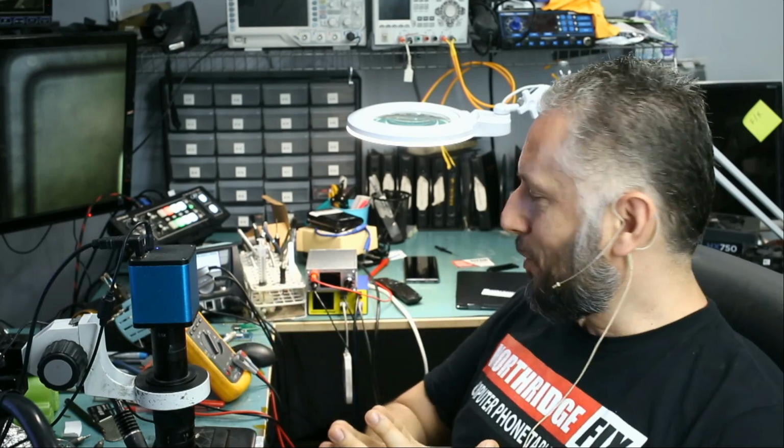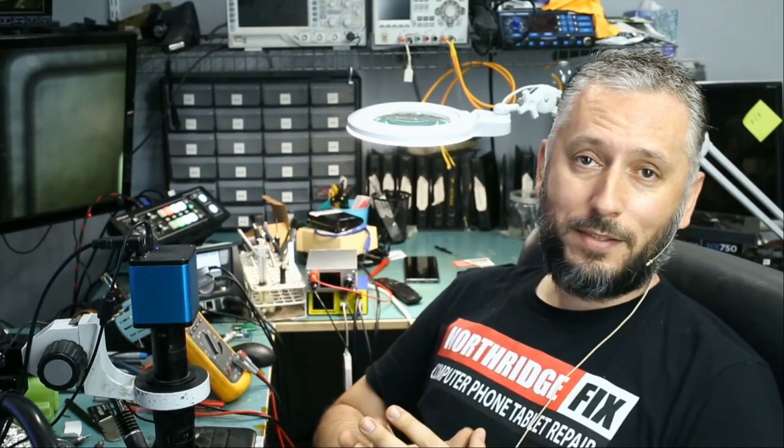We do not have any circuit or board diagrams for that motherboard. But I did notice that one chip, the same exact chip that's used on HP Spectre X360. And that chip is known to fail. I took an educated guess. I replaced the chip and laptop is working. We're gonna invoice and mail this back to the customer.